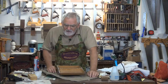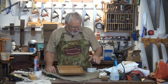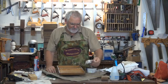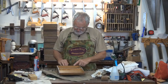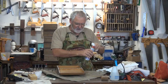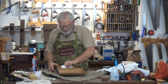Yep, 30 degrees is what I set mine at. No, not really. The only issue you get with a bigger mouth opening is you don't get such a fine shaving. But if you're not getting a shaving, that's what I feel the problem would be. Oh, I really don't know what's going on here. Give it a go. Can you take a photo of the back of the plane and post it, send it to me, whatever? And I'm happy to have a look-see.